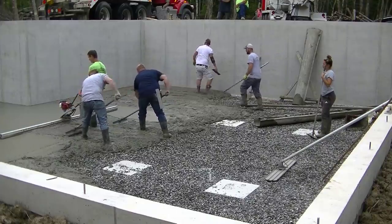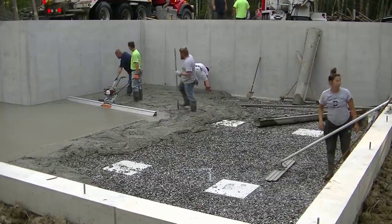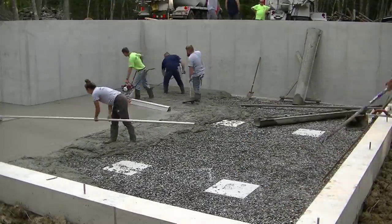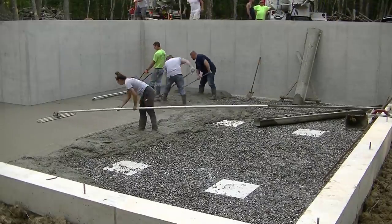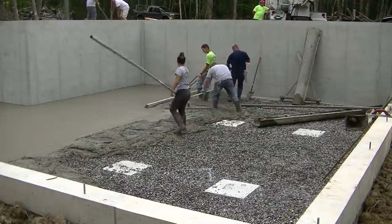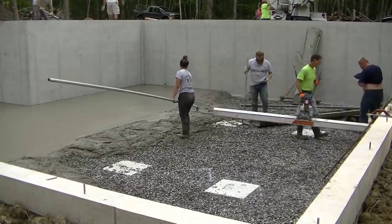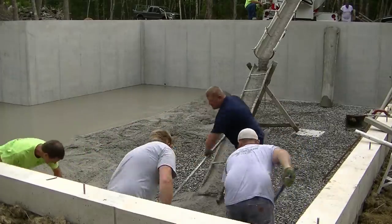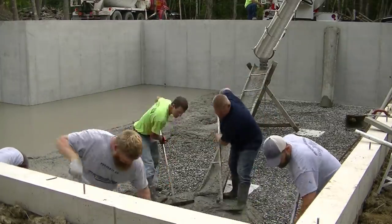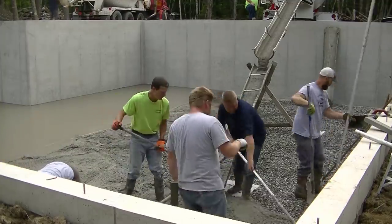Right now we've got to get this basement floor poured. We're also doing the garage today, but that'll be on another video. I wanted to show you guys how it is pouring over the top of a wall like this in a basement — it's a little more difficult than just backing the truck up to a slab. You've got to have the right chutes or pump it. Those pads you see in the middle are for lolly columns, and those columns will hold up beams that go under the subfloor — load-bearing pads. Then they'll run their floor joists over the top of those beams and build the house up from that. That's pretty common construction here in Maine.